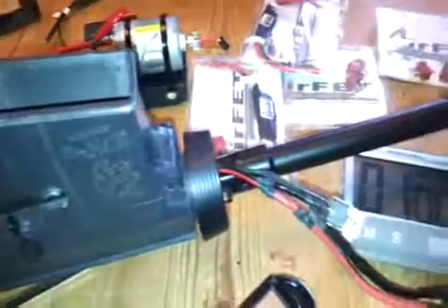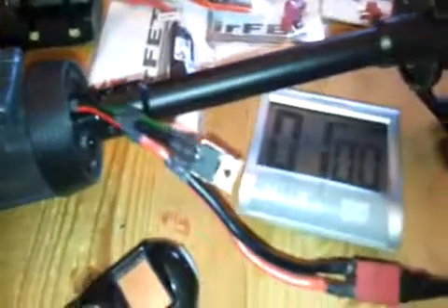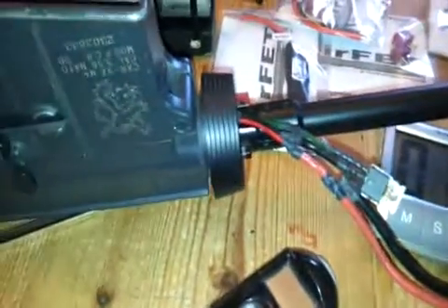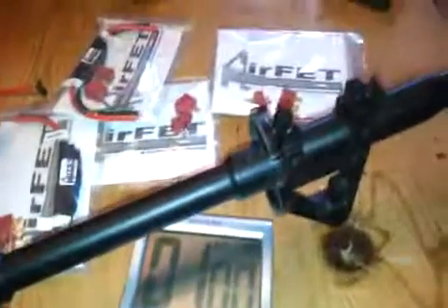I know because I've bought them. I test everything I've got before I send it out. The counterfeit ones fried and overheated - some of them overheated within 15 shots on semi, and they were actually marked up International Rectifier with all the markings and stampings, but they were counterfeit. So all of my FETs only come from reputable sources in the UK. I'm not going to give out who the suppliers are, but they are available. You do have to pay for them - they are expensive. The Chinese FETs were somewhere in the region of 20 cents each, but you've got to pay a few quid each for the genuine article. That's basically why my FETs are fairly expensive overall.